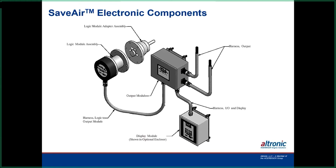Some of the cam drives, you can pull the housings off the back of them. Or the ideal way would be, if you can get to an old mag drive that's running the same speed as the crankshaft, it's an ideal place to put it. Again, this part has to be mounted somewhere on the engine, so it knows what speed the engine's turning.